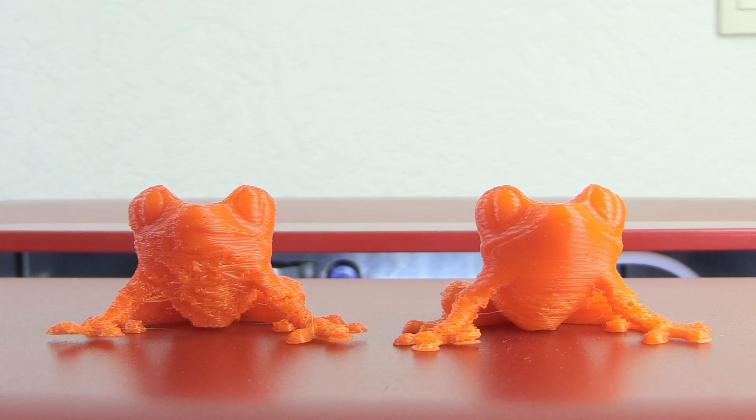As you can see, cooling for PLA is very, very good. I don't know if this cooling would also apply to ABS, because with ABS the problem is quite often that it cools too fast. But when working with PLA, it's very good to cool it because you don't have a problem with overcooling.